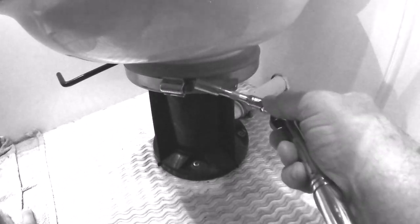Once that screw is out, these two little pieces come off easily. We'll set them aside and give them a good cleaning while they're out. Next step is to get the stainless steel clamp off, along with the two clamshell pieces. According to the instructions, the clamp fastener should be toward the back — someone replaced this before and didn't align it correctly, which is probably why the cosmetic collar wasn't lining up. We'll use a 5/16" or 8mm socket wrench to get that band clamp off.